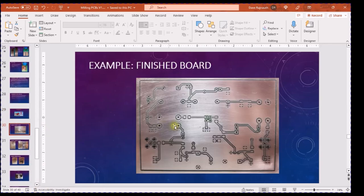Here are some finished products. Here's a board I milled — it's a nice clean surface with all the material removed. Those are 1206 SMD pads — you can see the holes drilled, and that's for an SMA connector with nice tight drill holes. The only thing I find with small pads is you need a little more clearance when drilling holes, because you'll get a solder bridge.